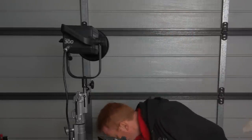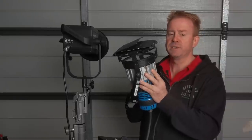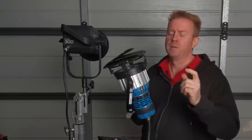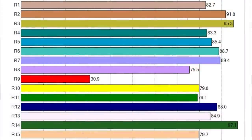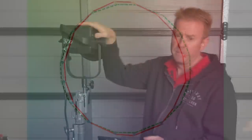Let's put that into perspective. A 91 TM30 color vector score — anything above 90 is really good. Let's compare to the color render you get off a small HMI. A lot of people think HMIs have extremely high color render, and that's true with 1.2Ks and above, but below 1.2Ks they perform pretty poorly. The globe in this Arri Pocket PAR 400 — a fairly new globe — was giving us a TLCI score of 78, and color vector testing revealed a more realistic score of 87. So not only was the LED brighter, it outperforms the smaller HMIs in terms of color rendition.